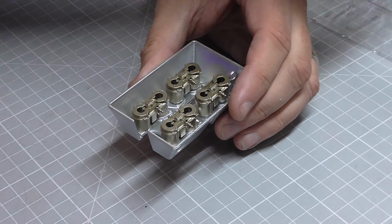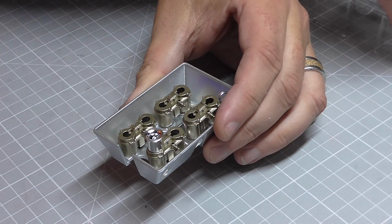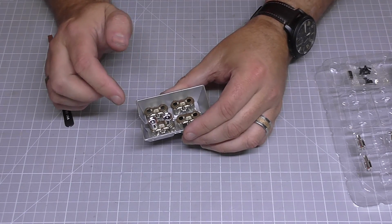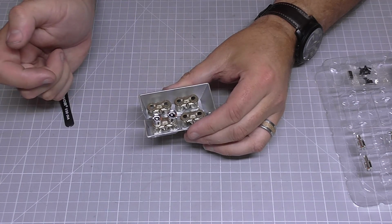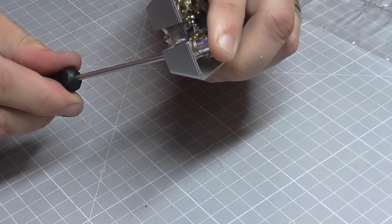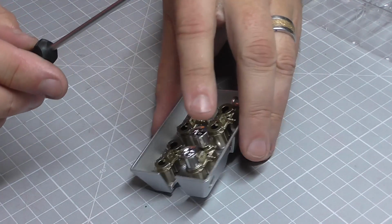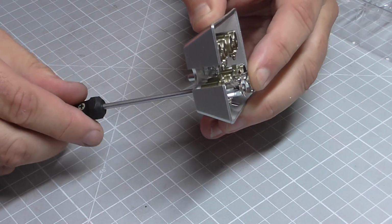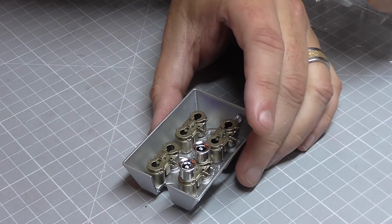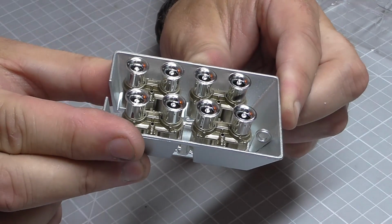So we need the diaphragms for the carburetors now, which look like this. They're just going to go into the top sections that we can see here. So we've got 1 there. And we're going to continue doing that for all the rest of them. But before we continue, obviously we want to hold these into place. So we're going to be putting an FP01 screw in from the other side, and that will hold each one of those diaphragms in place. So here's number 1. And just work your way doing all the rest of them. The way they've done it in the magazine actually is they've done 1 diaphragm at a time. But you know me, I want to do them all at the same time. But I will continue and get them all in. And make sure you put those keyed sections in correctly, but when that's done, it should look just like that.